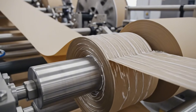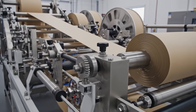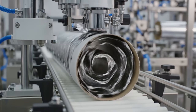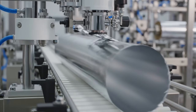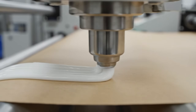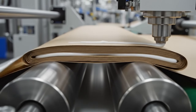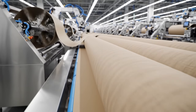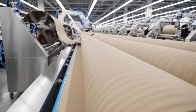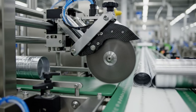Spiral winding: layers of paper and adhesive creating a rigid spine. The foil liner — this isn't just decoration; it's the barrier against air and moisture. Adhesive bonds the layers into a single, strong composite. The endless tube grows continuously, 24-7. The flying knife matches the speed of the tube and slices with precision timing.